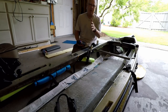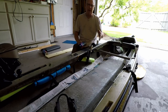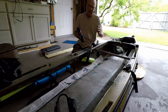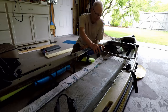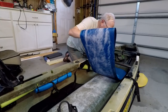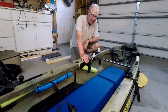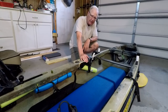Open up the garage door to get good ventilation — when you put that contact cement down you don't want to breathe the fumes. I've been shaking this thing for a while now; I'm ready to put it down, let it sit for a minute, and then lay the mat down. It would have been easier to do it in sections but I kind of want the entire one piece down there, and I'm willing to accept it if it's a little crooked. I'm going to hold it up here, bring it back, and line it up on my line. It came out pretty good — just that one little area I had to fix — and I think that's going to be a nice smooth surface that's going to absolutely deaden the sound when I'm scraping bait containers around.